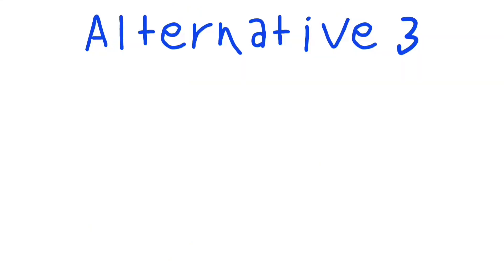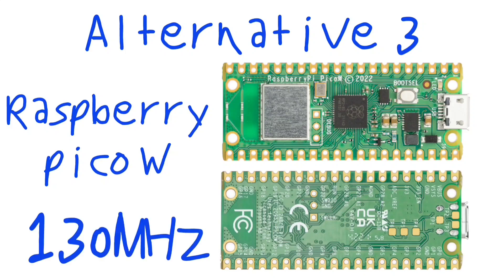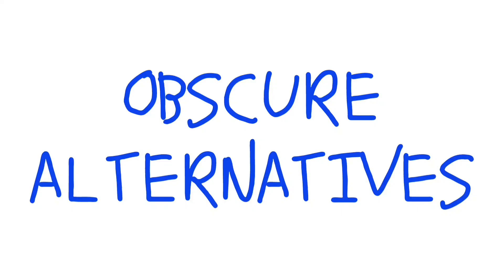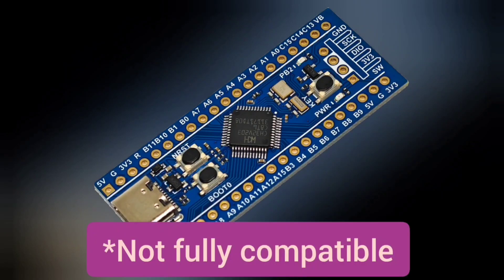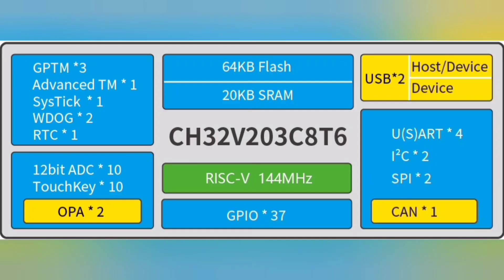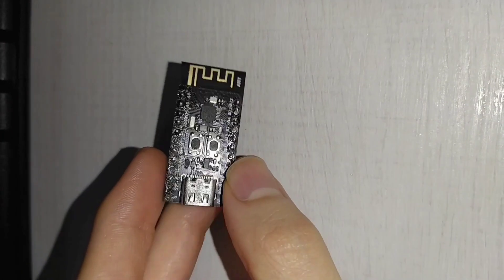There's also the Raspberry Pi Pico W, which runs at about 130 MHz. It has Wi-Fi and Bluetooth, 2 UARTs, 2 SPI, 2 I2C, and it's pretty cheap. There are also more obscure alternatives like the CH32 series boards that you can program with the Arduino IDE — the ICs start at 20 cents and have pretty good specs. From the same manufacturer, I bought this CH592 as you can see here.